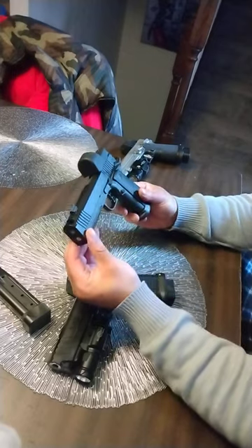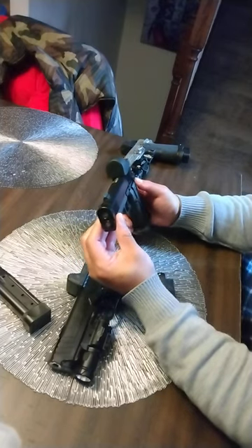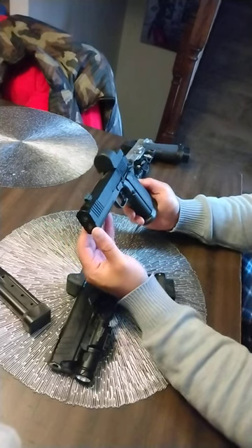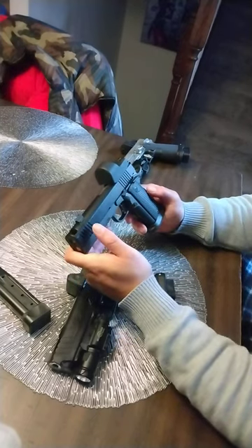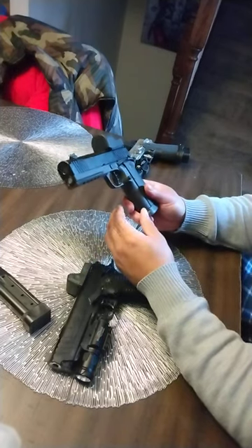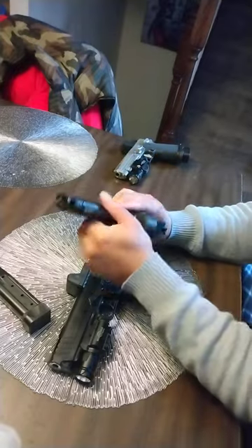When it came back he told me my trigger wasn't that smooth - I had it between three and three-and-a-half to four pounds, and it probably wasn't smooth, I'll admit that. He told me the Red Dirt has a trigger that will more than likely fit it - the Red Dirt PT trigger, which is probably a Phoenix Trinity trigger. That bow is probably a little wider and most aftermarket triggers don't function in this firearm. So I said I'll give it a shot but in the meantime I'll hone and polish these internals.